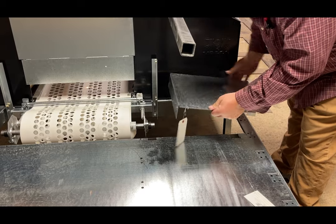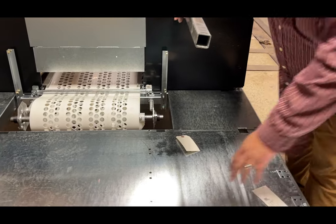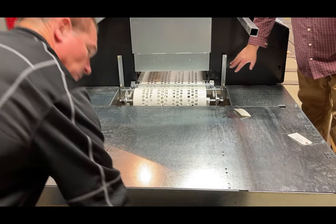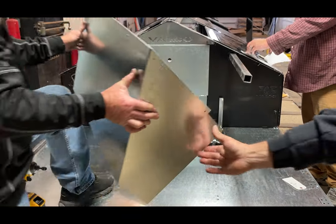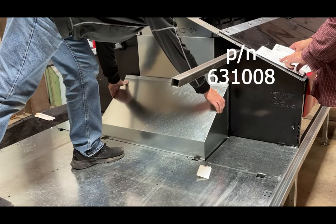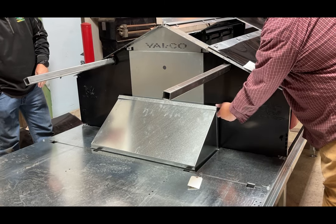With the extension down so you've got a perfectly good walking space, we'll put some self-threading bolts in here to hold everything in place so it does not slip. Now we're going to attach what I would call our dog house, or our cover for the idler end assembly. That is part number 631008 — there are threaded studs on the back side of those arms, so we can just thread bolts right into that to hold it into place.